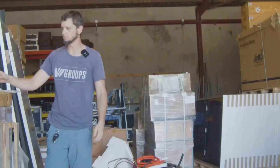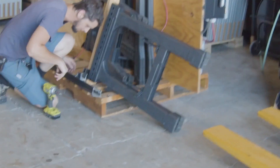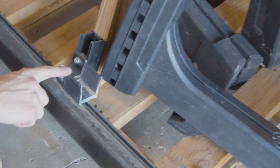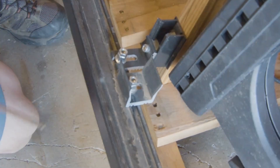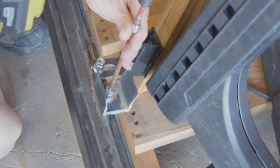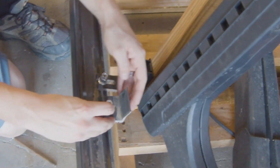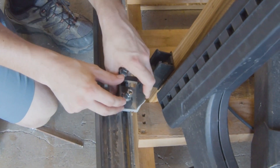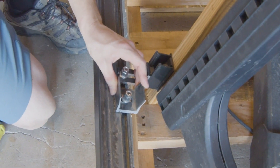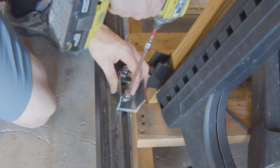I am going to have to adjust my rail here at the bottom. Those were 40 millimeter panels. This guy here has a marking where it's set to 40 millimeters — that's the space for the panel to sit in the gap there. And that didn't work well, so if I can get my T-bolt back in, I can move that to 30 millimeters. These things want to be all fancy with their round bit, but that doesn't work well.